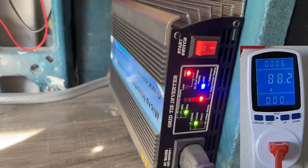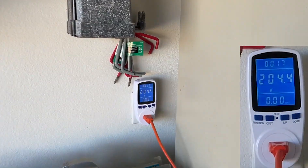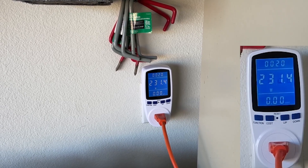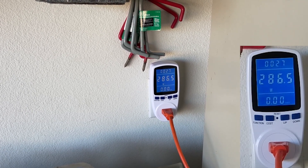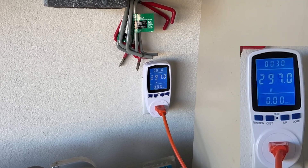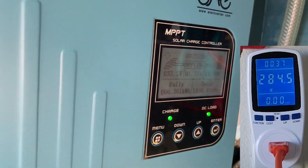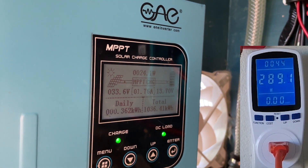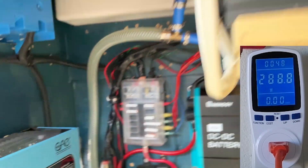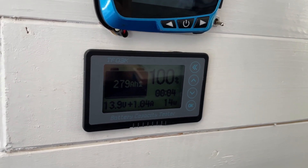Let's check it out in the garage. It is reading — we are feeding 230, 250 watts back into the house — and climbing. This is excellent. It also looks like while the grid tie inverter is powering the house, I'm still powering the van and keeping the batteries topped off. I'm still just topping off at about 23–24 watts, of which only about 15 watts is actual charging — the rest is going to parasitic draws inside the van. Very cool.